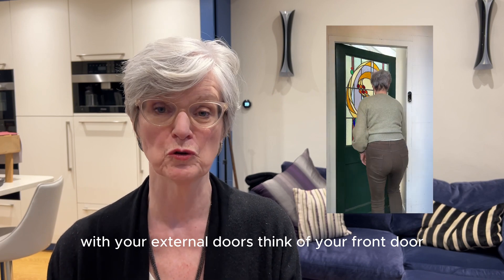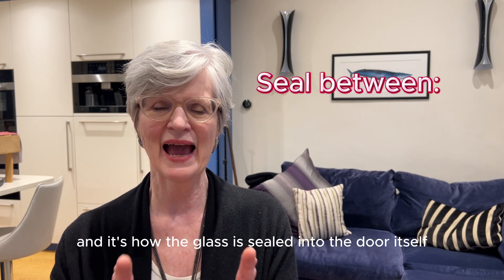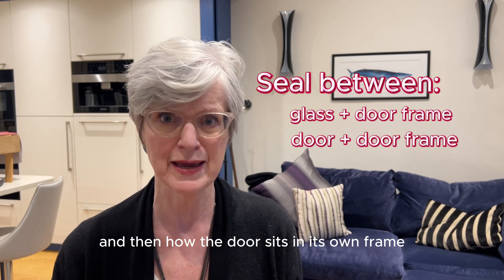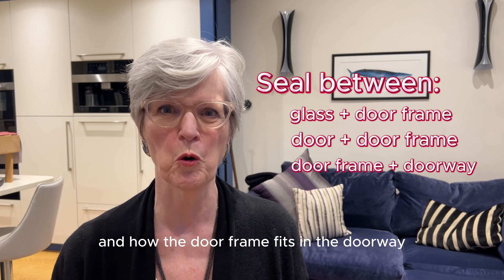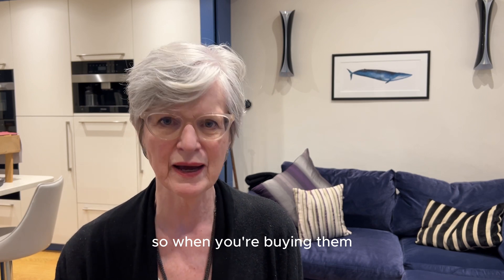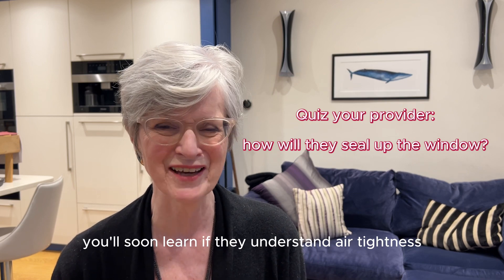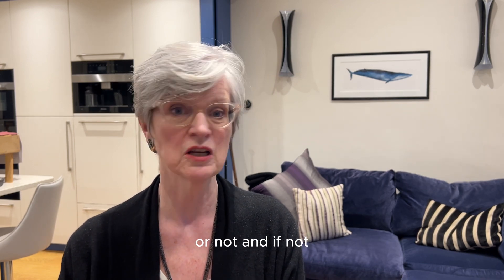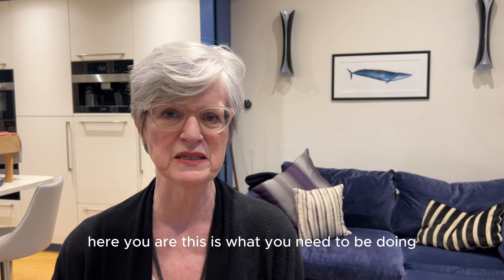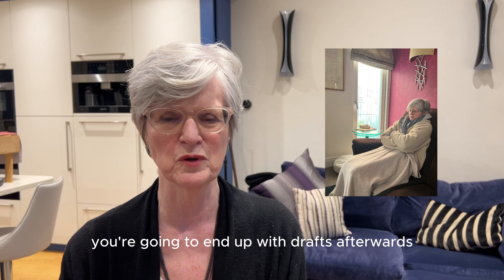You'll have exactly the same issue with your external doors. Think of your front door — maybe you've got some glass in it; again you need good double or triple glazing, and it's how the glass is sealed into the door itself, then how the door sits in its own frame, and how the door frame fits in the doorway. Each of those places is a possibility for a break in the thermal envelope. When you're buying them, quiz the people fitting them — find out what they're going to do. You'll soon learn if they understand airtightness or not, and if not, talk to other providers or go searching online.